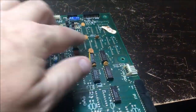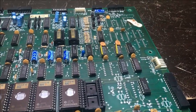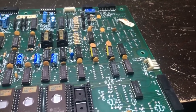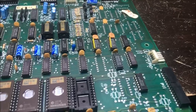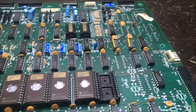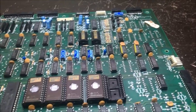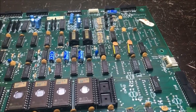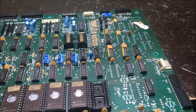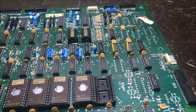But that's the 3 things that you have to do if you want to run it on a regular monitor, say a G07 or a modern LCD monitor or anything like that. It's gotta be the correct video signal. And Nintendo boards output an inverted video for the Sanyo monitors. It's just how they worked. Don't ask why. It's just how they worked.